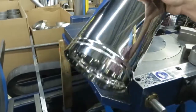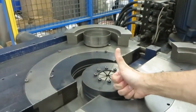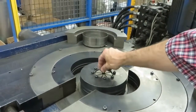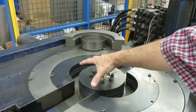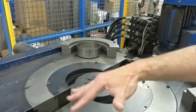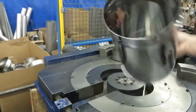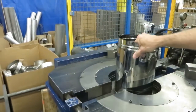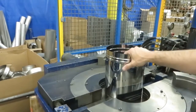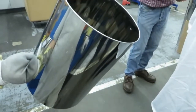The old way of doing this — and a lot of people still do it this way — all you have is a tapered shaft that comes up, controlled by a foot pedal. As that shaft comes up, this expands out, but it only has it on the inner. So depending on the operator, they're going to put it on and turn it as it goes. Every pipe could be a little different. The inner-outer tooling takes the operator out of the equation, so it makes them all identical.